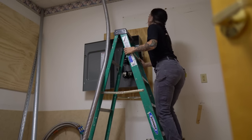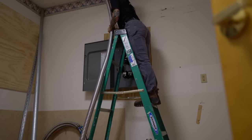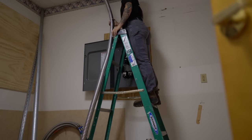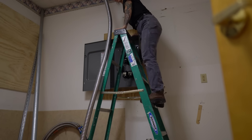Now it's time to knock out the center knockout at the top. I don't know why — usually I don't have an issue with Square D — but this Square D panel only knocks out from the top or the side. So I'm knocking out at the top and then I'm going to strip this giant MC and get it in with a piece of EMT on top. Let me show you what I mean — I was pulling the wire there.